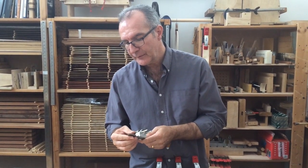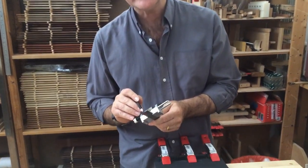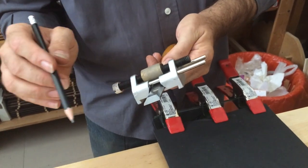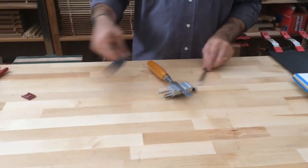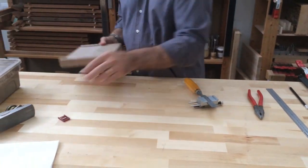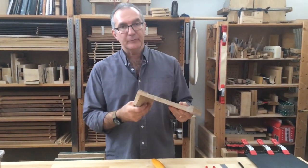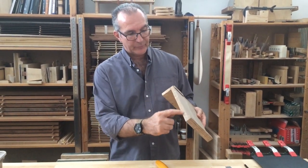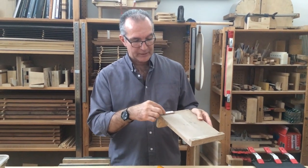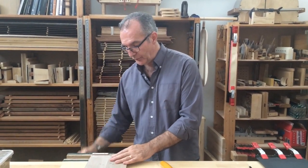Now I have a brand new front edge and only one facet as a bevel. I'm going to put this to one side and start working with my water stones. I have this little block which is basically going to help me keep the stones from moving around — it's a piece of plywood a bit longer than the stones with two stops and one section so I can clamp it in the vise.